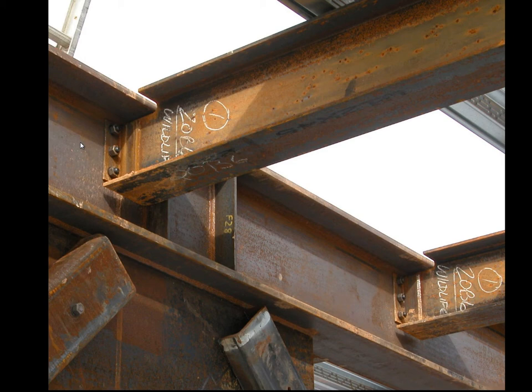We'll talk when we discuss integrated systems in the next few videos, where actually this wide flange is put up on top of this primary girder — that's done to allow airflow over the top of the girder. But that's a fairly unconventional or recent development, and this is the conventional way in which secondary beams are attached to primary beams.